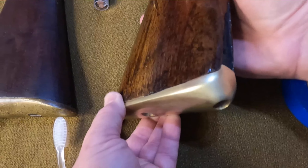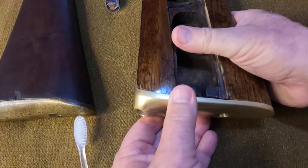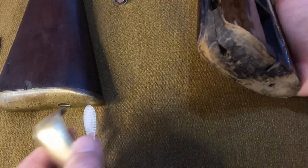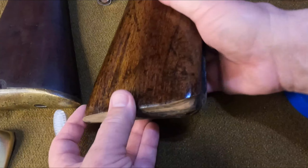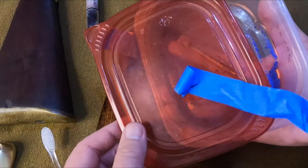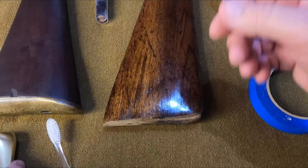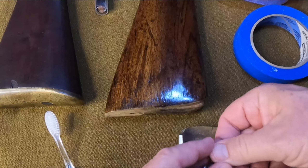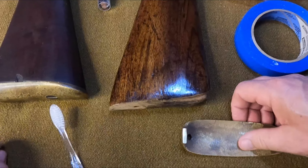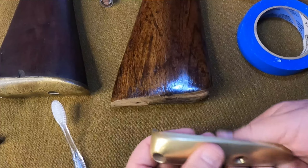In the old days they would use lamp black or some kind of charcoal as their medium to show where the metal was touching. I just had this powder from the chalk line and it worked fine. That's how you get it to fit tight and to the right width — you need a little tape, a little leftover latex paint, a file, and some patience.